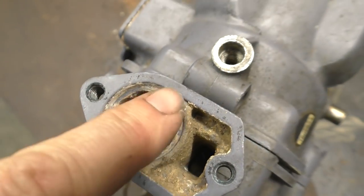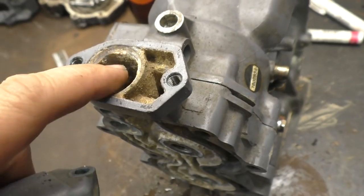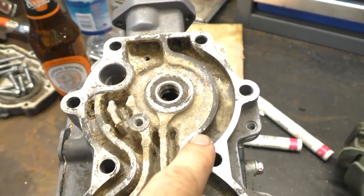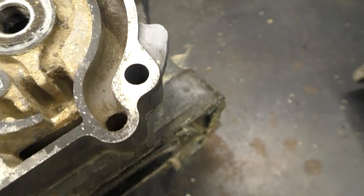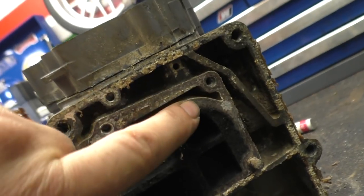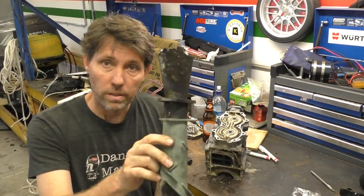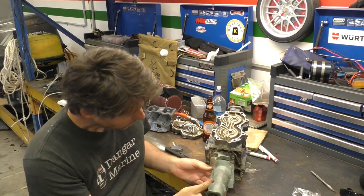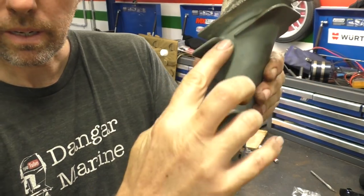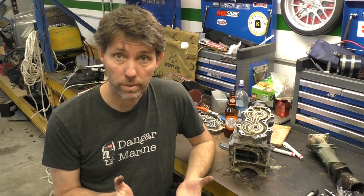Now for the final piece of the puzzle. Cooling water comes up to the thermostat, the thermostat opens, and this little cover provides a path for the water to loop back over. The water comes out the thermostat and back down here — that passage runs down the other side. When the water gets to the bottom it goes down this hole, and shining a light through we can see it coming out two places inside the casing, and then down here into this exhaust manifold. This is where the exhaust comes out — it looks designed to run down the outside of the exhaust to keep it cool, rather than going through the center.